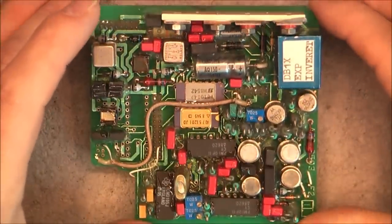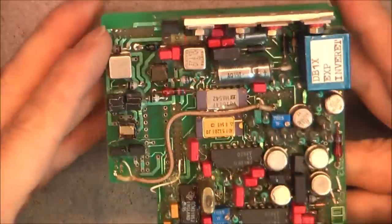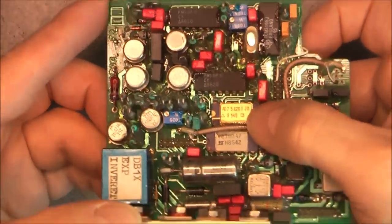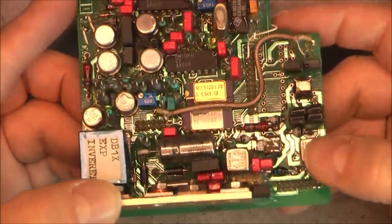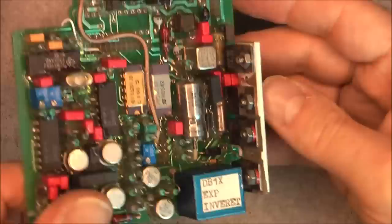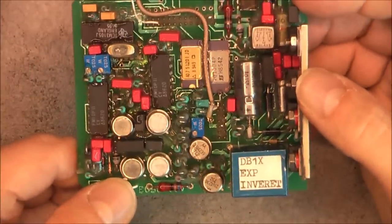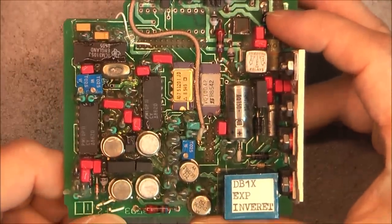So we have this board, and no particular information, model number, or function information. Military grade chips, 80 something here, so maybe analog digital converter, gold top, of course your sealed wet tantalum capacitors, super fine, super small relays here, some voltage regulators and power transistors it seems, trim pots. So seems to be some kind of intelligent control panel, indicator panel, this thing.